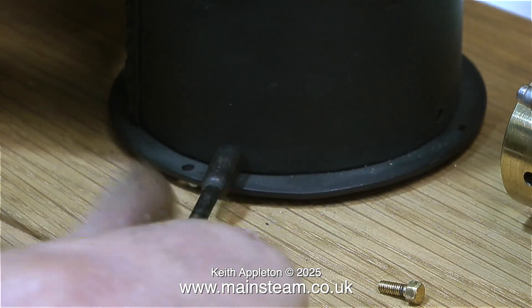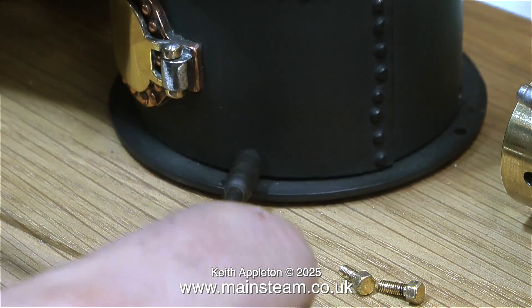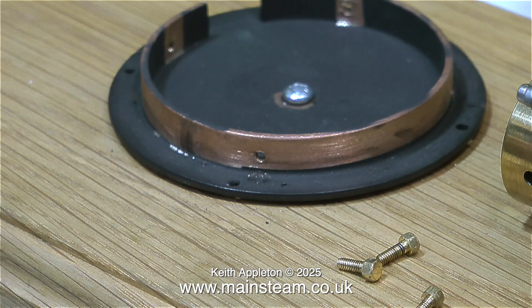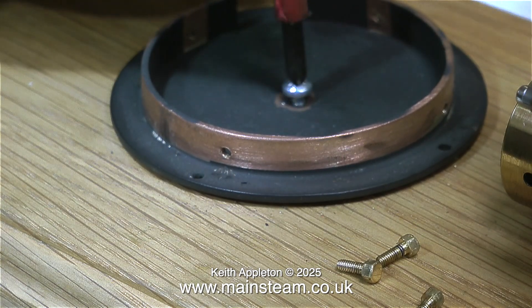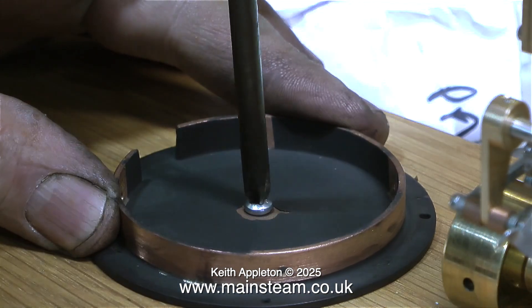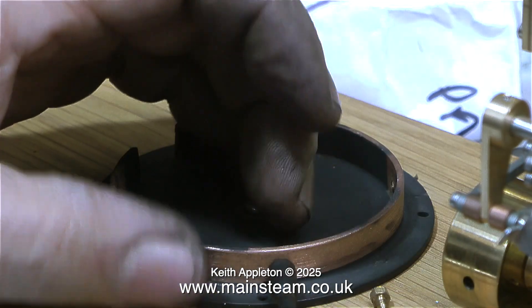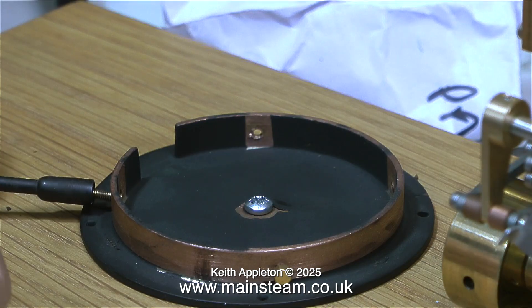Before I send the steam plant back to the customer with my apologies for not repairing it, I do need to fix this. In this clip I'm removing the boiler shell from the base plate — it's held in place by brass bolts. Now I can lift the boiler barrel off the base, and here you can see the problem: owing to the constant movement of the boiler because the chimney was sticking out of the package, the soft copper base has become concave. I just need to remove the central screw and flatten the base very carefully using a piece of wood and a hammer. Now when I screw the mounting plate back into the baseboard it's nice and flat. For transit I'm not going to refit the boiler to the base — I'm refitting the brass bolts so I don't lose them, and the main boiler barrel will be packed separately with plenty of bubble wrap.